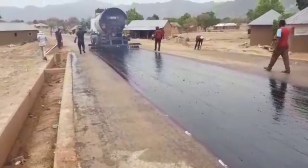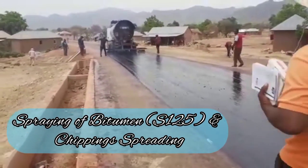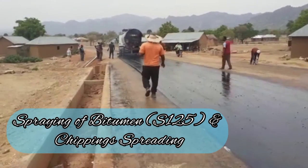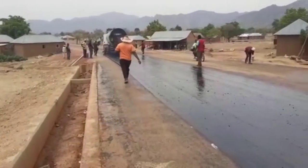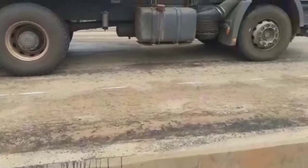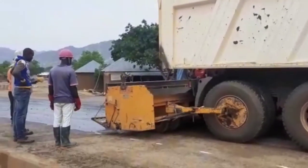Welcome to my YouTube channel. As you can see, we are spraying S125 on the carriageway, which has a width of 10.3 meters. Before the spraying of S125, you can see the white markings or white paint which we had used for our alignment.